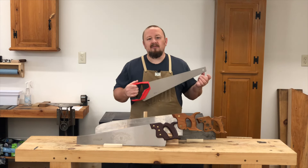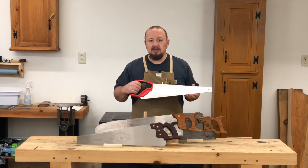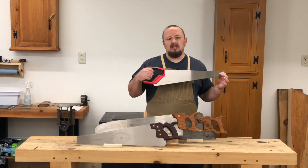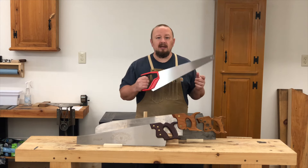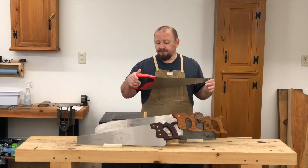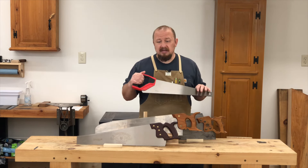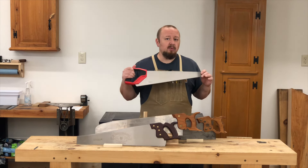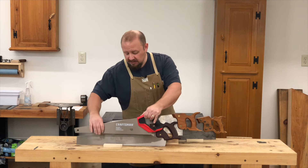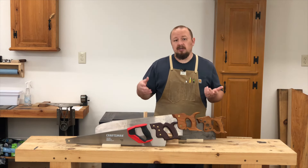Really, that's what they're designed for — they're designed for the DIYer, the construction site worker who needs to make one or two cuts that they can't make with their circular saw or their jigsaw. These saws are really not designed for us to be using in a shop on a day-to-day, regular basis. Now they are fine saws for cross cutting rough lumber, breaking down rough lumber. I keep this one in my toolbox for basically home improvement, carpentry, site work type of stuff. But for everyday fine woodworking, this is not a saw I tend to use. It'll work fine for breaking down your rough lumber and doing your cross cuts, but you're not going to find one in rip — and when that saw does get dull, it's essentially a throwaway saw. You go out and buy a new one.